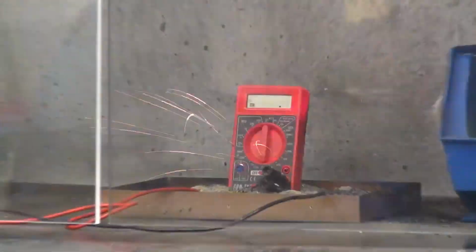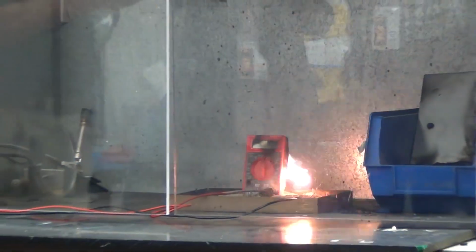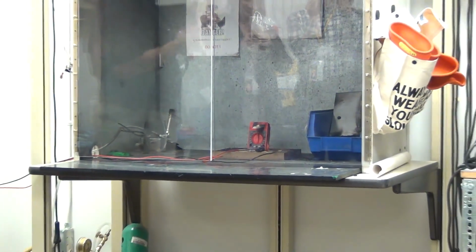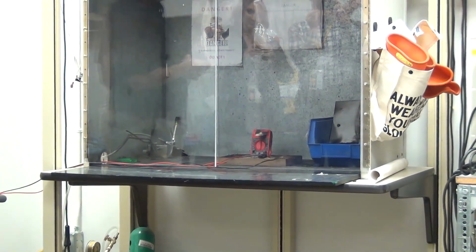The reason you don't want a meter exploding in the piece of equipment that you're working on, not only that you just don't want a meter exploding, but that ball of flame has carbon dust, copper vapor, ionized air, etc., and it is conductive. So if you create an explosion near some contacts that have a very large potential, that arc flash will expand, right? It won't just stay in that small explosion like you saw in the video. It can move over to some contacts and create a much larger explosion.